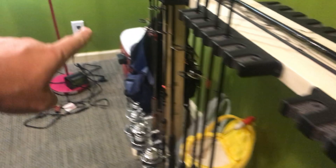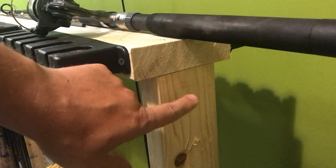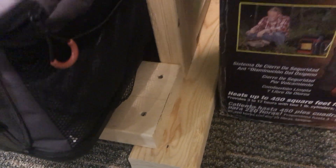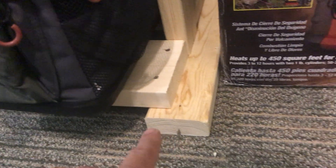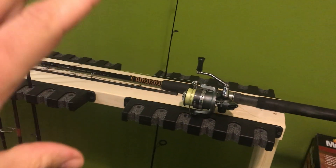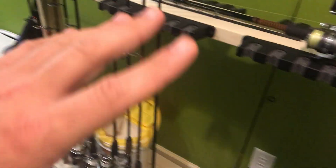Now onto the 2x4. You need two for uprights — those are 36 inches long. The way they go together is underneath the 2x6 on top and on top of the 2x4 on the bottom. So those two are 36 inches long. Then the feet — you've got two of those at 16 inches long. The simplest way to look at this: you only need one 2x4 at 8 feet long, and you should have enough materials to build the whole thing.